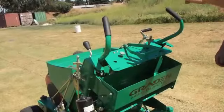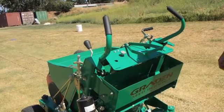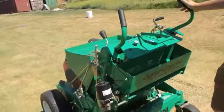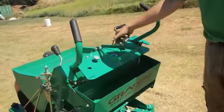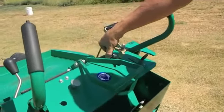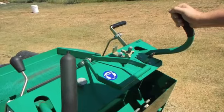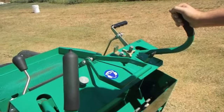We have our blade depth, we have our sand flow rate. Now we go to turn on the machine. Once I've turned on the machine, I will line it up to get my cut. I will then engage the blades, turn the control locking mechanism on, and basically push down as I know that the sand is calibrated to the right blade depth.